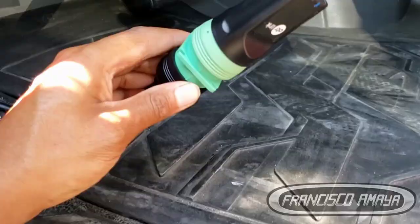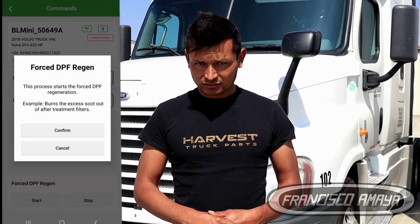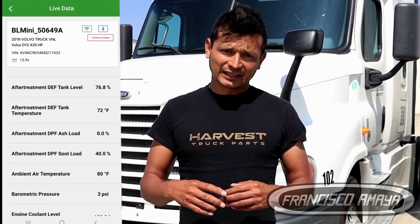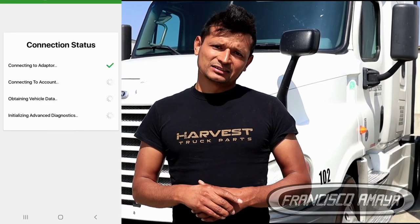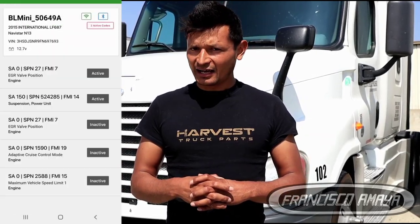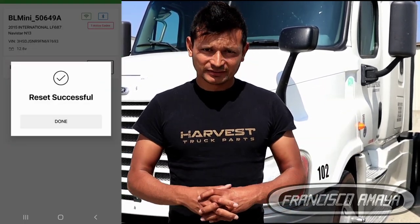This tool is pretty capable of doing many different commands on the vehicle. If you get the PRO version, you are able to connect to different heavy-duty vehicles. For example, I tested it on a 2019 Volvo VNL with a D13 engine and I was able to read codes, do regeneration, and perform special functions and commands — which is very helpful because Volvos have very specific diagnostic systems. I also connected to an International ProStar with a MaxxForce engine and it gave me the ability to read codes as well.